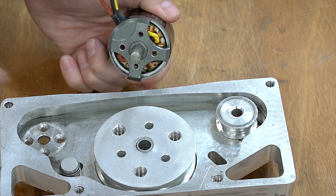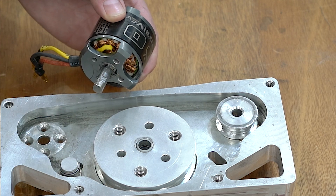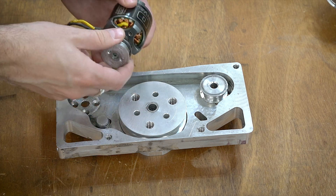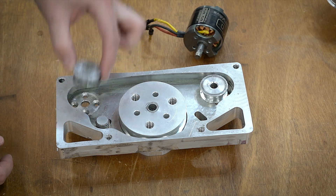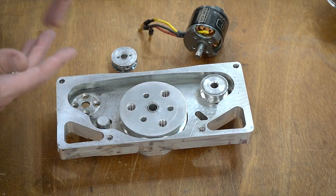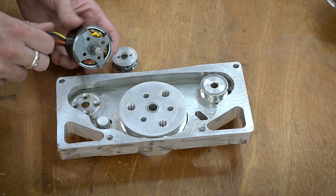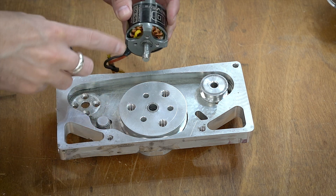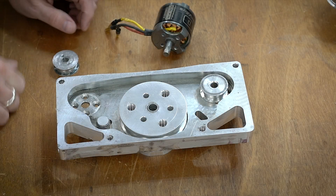I think these shafts are a little bit too soft, so I'm going to completely remake the shafts and actually do a keyway in here — which is the same thing I did on the drive. The downside is the pulleys won't be captive in any way and could just pop right out, but there is a plate that covers the whole thing so they shouldn't really go anywhere. The biggest change is making sure that the pulley and shaft are properly coupled so I don't get all this galling inside of there.